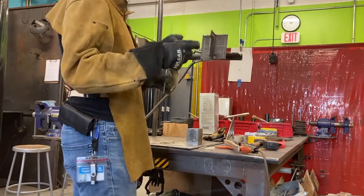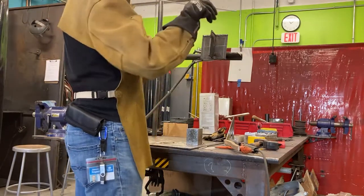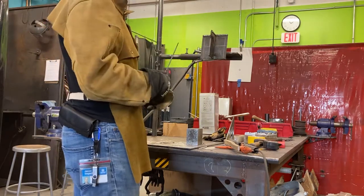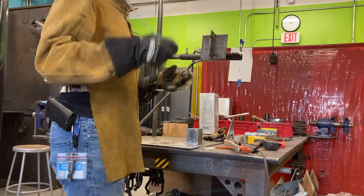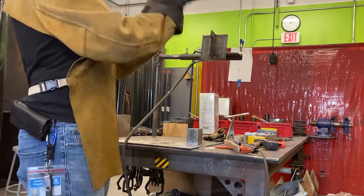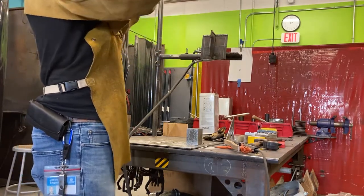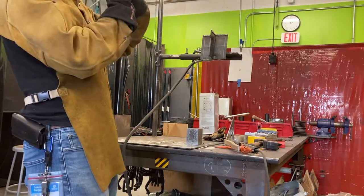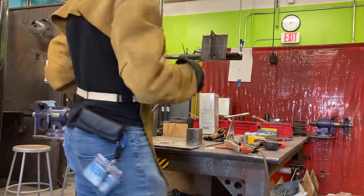When we saw this last semester, students were absolutely baffled why their welds kept falling at the end, curved, and when they looked at their body movement, it was like, aha, I didn't realize I was doing that. In vertical welding, you're welding and all of a sudden at the end it goes zzz, as it arcs out, because you're pulling the rod away as you go up. Your arc extends and you get this huge plasma blow melting everything.